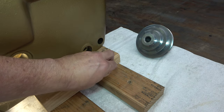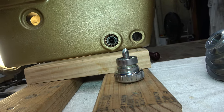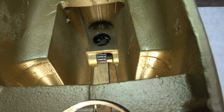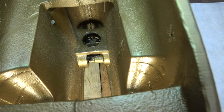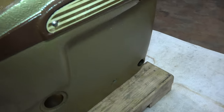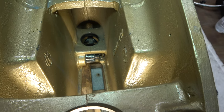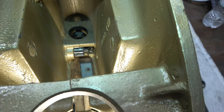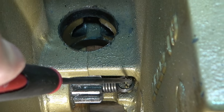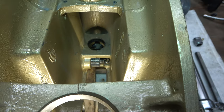Taking a closer look at the feed tension knob assembly and the feed return spring inside the pinion, you can see that the feed return spring has a dog leg on it. If we pull out on the hub, it's going to pull the spring and the pinion out, because there's nothing retaining that spring inside the head casting. On the Emerson, there's no knob on the outside, and on the inside there is a roll pin. If we pull out on the hub, you can see that the spring is retained inside the head. You can see the roll pin and how the spring has a double loop that wraps around that roll pin. This same design is what we're going to see in all of the generations of Emersons.